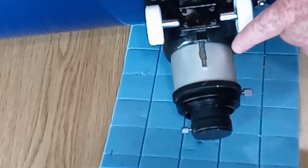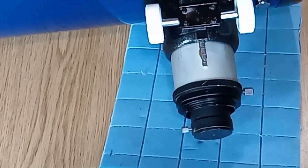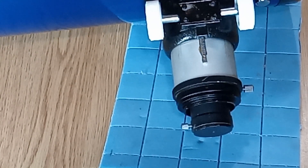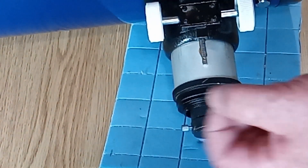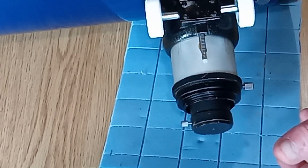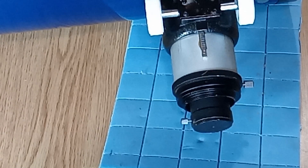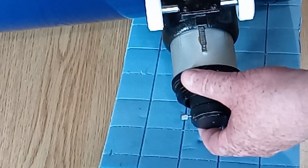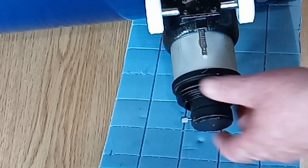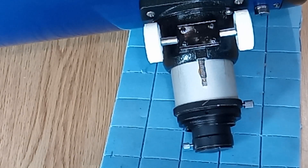You might be able to pick up on camera there are some little streaks of grease up here from where I greased it last. Inside this tube, we've got a couple of nylon strips which have little lines on them. This tube grips up against those, but there's a little bit of play — it wasn't quite a tight enough fit — and that can induce camera sag and tilt, or sensor tilt.